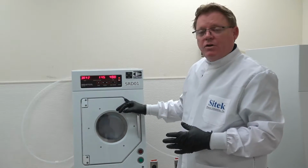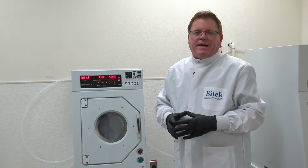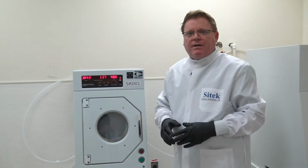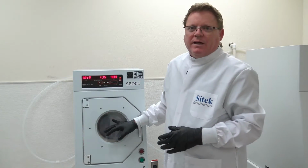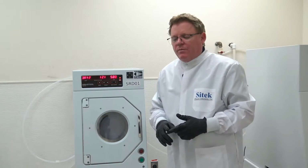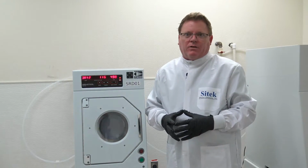One of the features of our new system, it's called the Slick device again, on our software, we have what's called the N2 Saver feature. It's a button that, by pushing it, whenever the system becomes idle and the wafers have been removed, we automatically turn off the LPP, low pressure purge. That uses about at least 75% of all nitrogen while the tool is idle. By doing that, the customer can save anywhere from $4,000 to $6,000, and even more if they have a larger tool, per year annually.